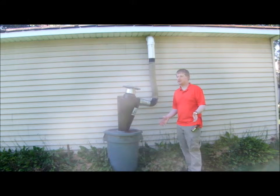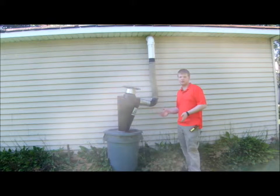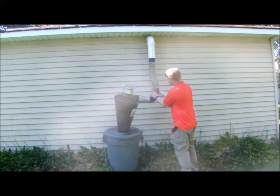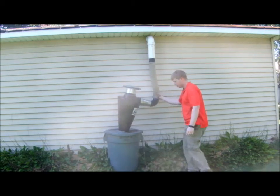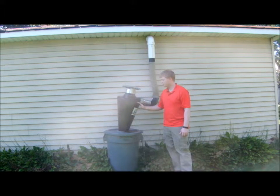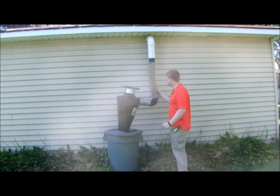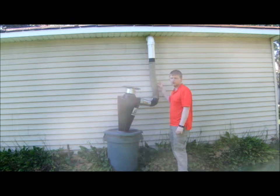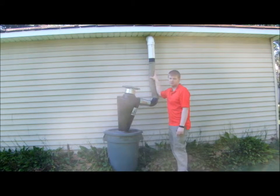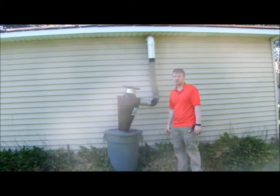I'm back outside a few months later. I want to point out — I installed this system in December of last year and it's now October, so it's been in for about ten months. What did happen this summer is I got a crack in my hose right here, which is why you can see there's a little bit of dust around. The reason this cracked is because of the sunlight — the UV rays hit it and deteriorated the plastic. So just be aware that if you're going to use 4-inch dust hose outside, sunlight's going to be an issue. I have plans to replace this piece of hose, and I'm actually going to spray paint it with something that has a UV-resistant spar in it, which will resist the sun's UV attacks.